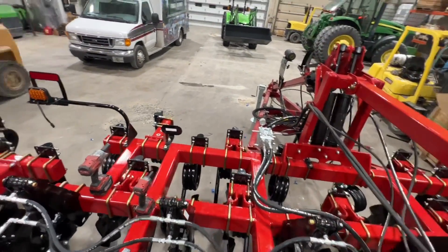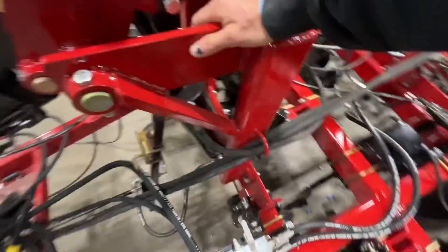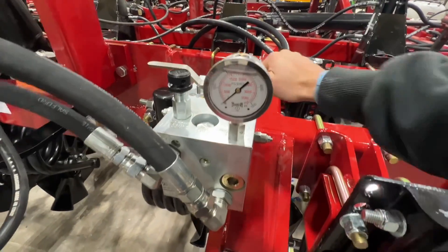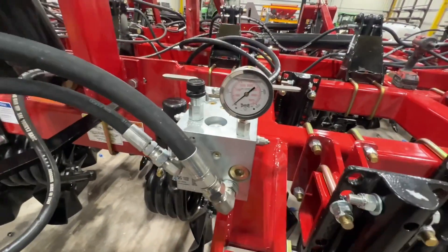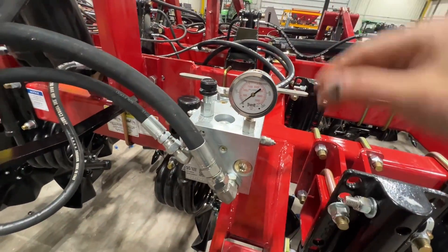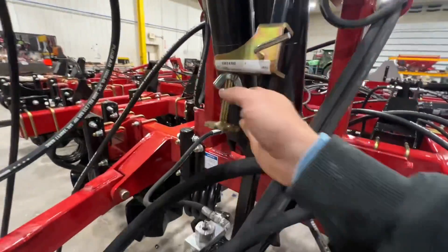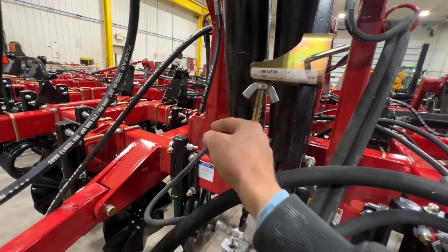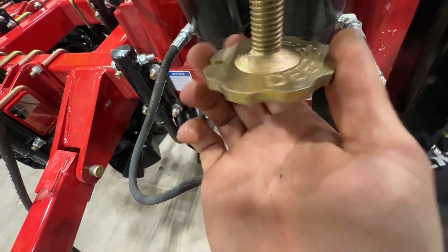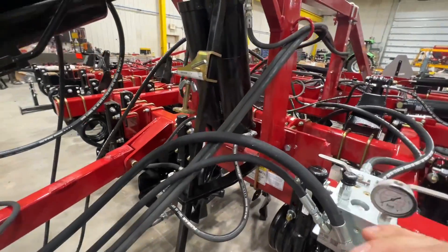Let's go up front and check out this hydraulic block, because it's what does all the work for the hydraulic shanks. This is where you turn your hydraulics on and off, and this is also where you control the down pressure on the hydraulic cylinder that controls your trip force. These two hydraulic lines — pressure and return — go to the tractor. Right here is your depth adjustment: you loosen the wing nut, and it's labeled — deeper is this way. It has a notch and every turn is one quarter of an inch of adjustment, so you can really fine-tune this.